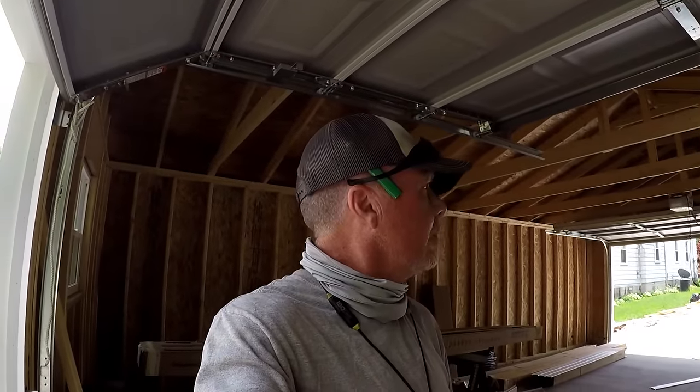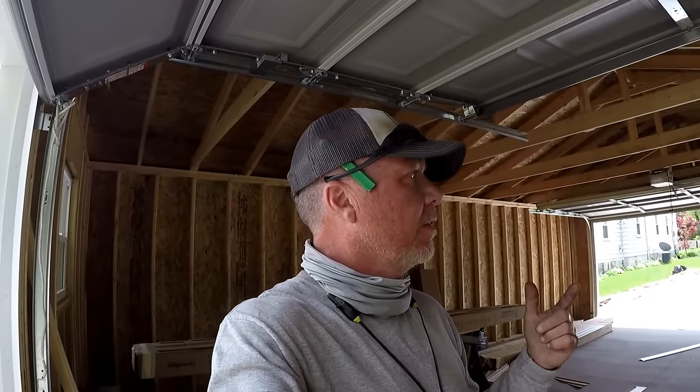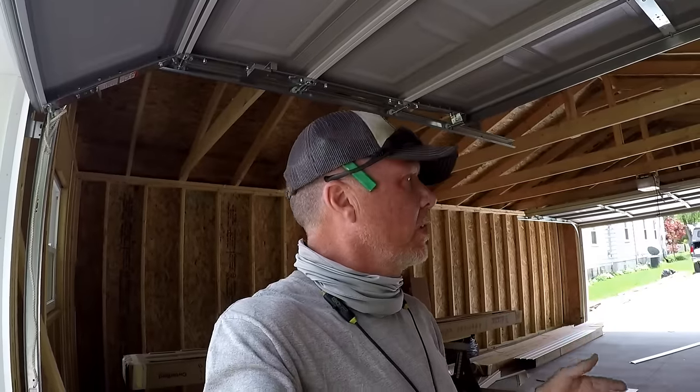It was kind of grueling. It took me 4 days to do it, which actually is about my pace. About one day per wall. The first day was the house wrap and wrapping the doors with the metal, installing the windows and the door, getting the lock set, blah, blah, blah. So that's stuff that kind of should have been done under the framing, but I left it purely for that day. Second day was all of the overhang, all the soffit, all the rest of the metalwork.